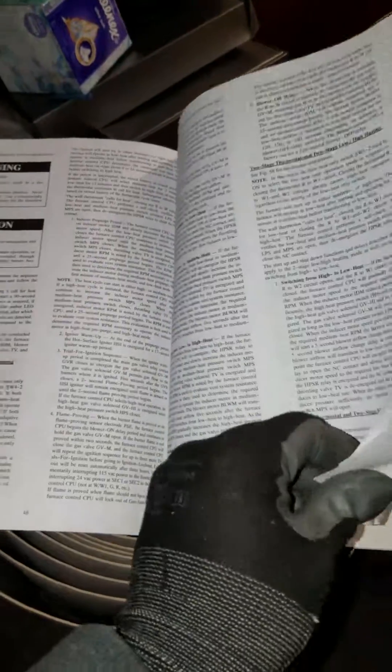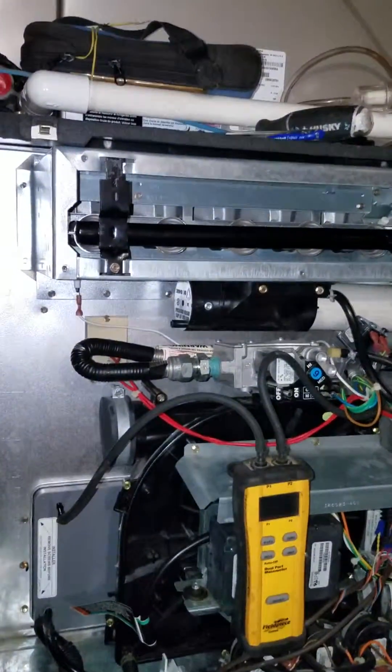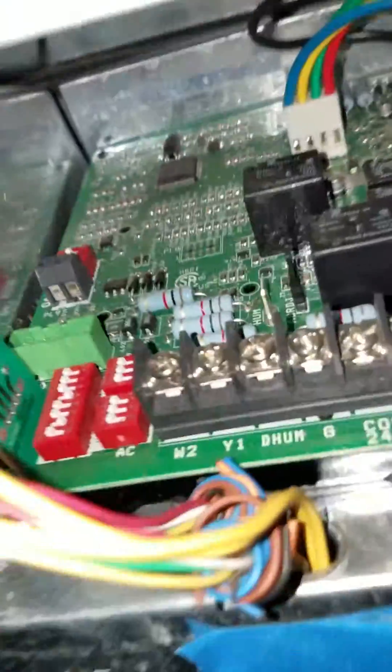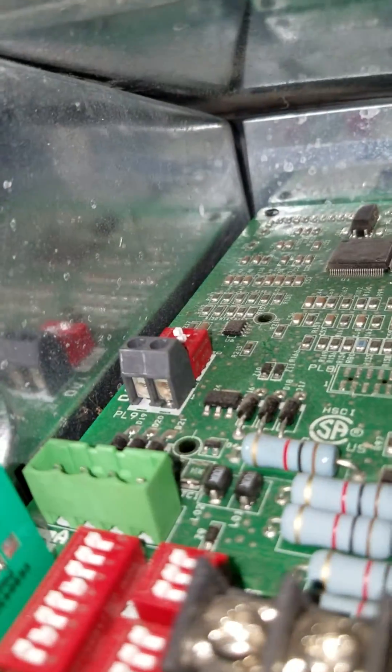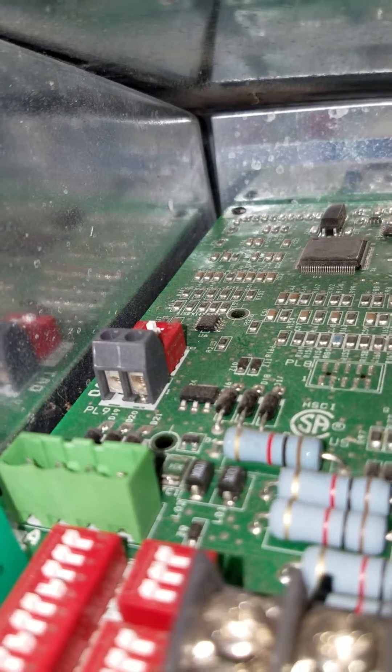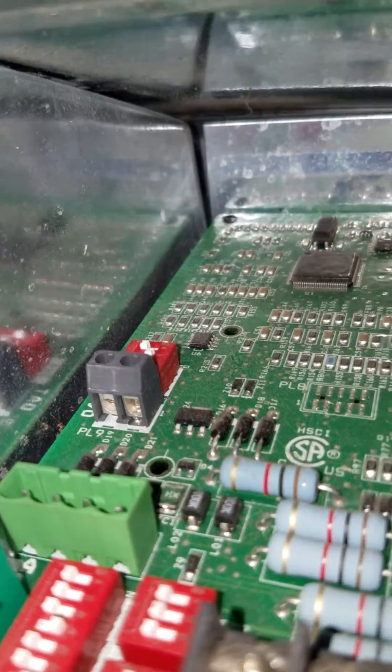It has some pretty in-depth instructions on the sequence of operation. So if you need help with what it's supposed to be doing, there you go. Gas input rate — so I'm going to go through this per the instructions. The instructions say to remove this box and also remove these caps before you start. Then you're supposed to start on medium pressure. There are some dip switches back there — it wants you to turn 4-3 on. That's dip switch set 4-2, and the middle one is two out of three — there are three switches and you want to turn number two on. That locks it into medium.